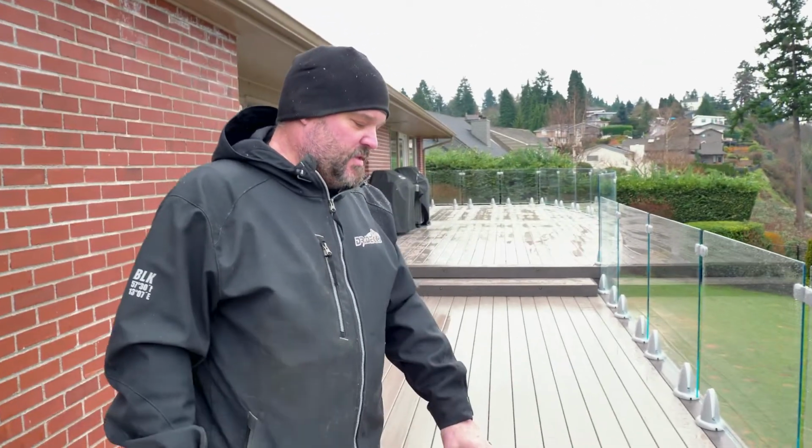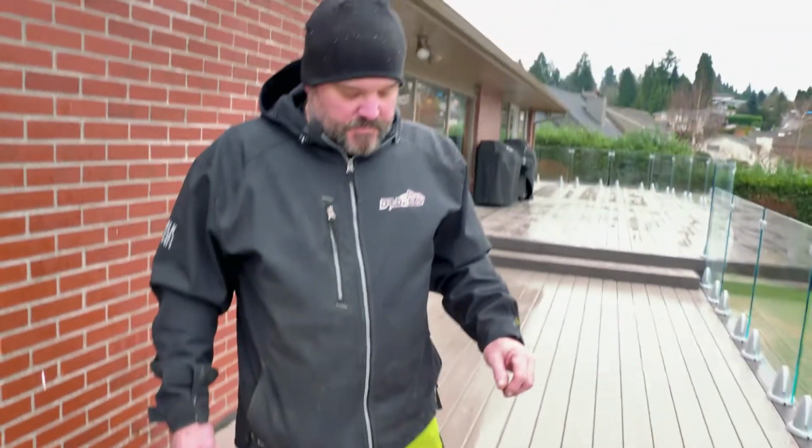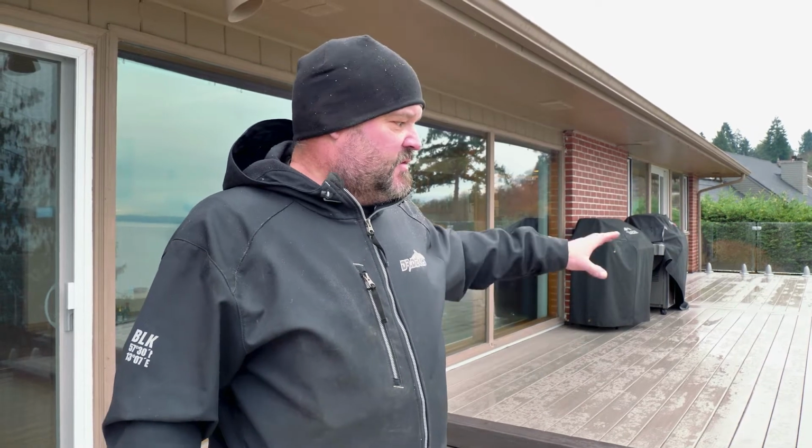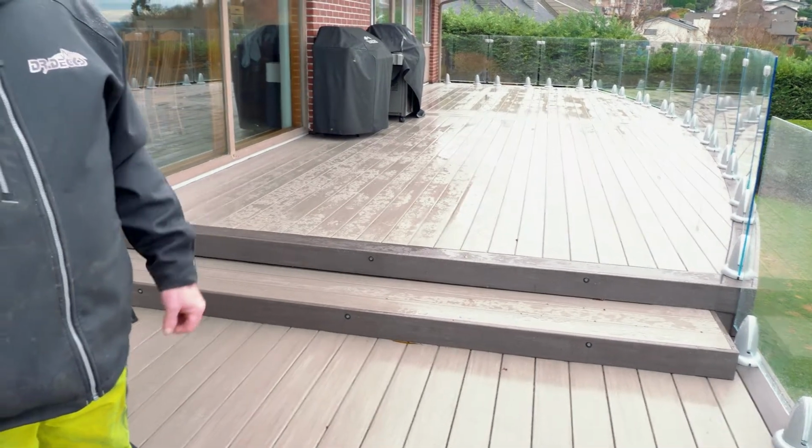So that's what we accommodated our clients with. We have double surface borders in the middle, just as a break, because of the way we frame the deck and because of how we had to deal with some of the other challenges of keeping a deck waterproof while still trying to do double surface borders. We chose a double instead of a single. The house changes levels and the old deck changed levels, so we went with that theme again and kept the deck at a stagger. Half the deck is about 10.5 inches lower, and that also reflects inside the house. So we basically stepped down in the same spot as they do in the house. It's basically a 5.25 inch step, and then a 5.25 inch drop to the lower deck.